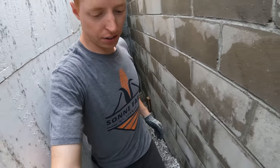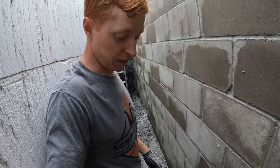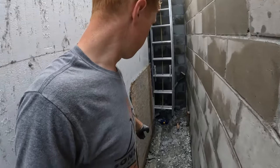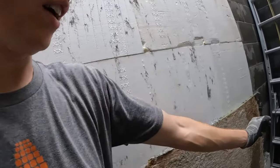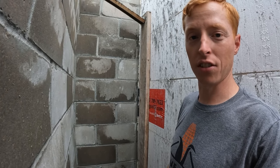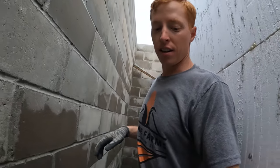As you can see, we've got a lot of concrete here. I just decided to dump all the extra stuff in here and use it for backfill — just kidding. We actually had a mishap: we blew up this corner. If you watched the previous episode, you'd see that I did not shore up these walls well enough where they tie into the block walls. It was very stressful — I actually felt sick for a day after. But I'm recovered now — it's two days later and I feel pretty good. We also got five inches of rain last night and everything did fine. Really glad we poured 24 hours before that rain.